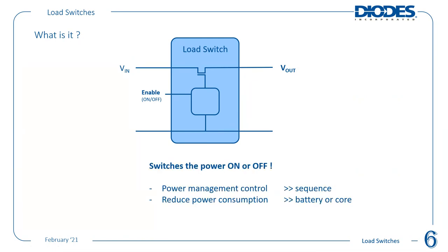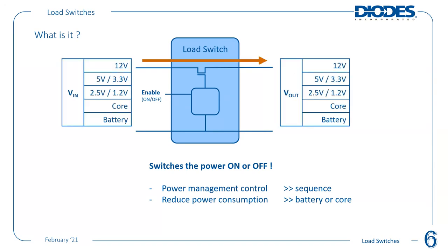A power switch is quite straightforward — it just switches power on or off. It allows power management control for sequencing across several areas, as shown in the power tree block diagram. A load switch doesn't convert power; it doesn't change voltage — all it does is deliver it through, turning it on or off, with control over how you do that. Turn-on slew rates are adjustable for soft start. It could be 12V to 12V, a core voltage 0.8V to 0.8V, or a battery voltage discharging from 3.3V to 2.6V over time.